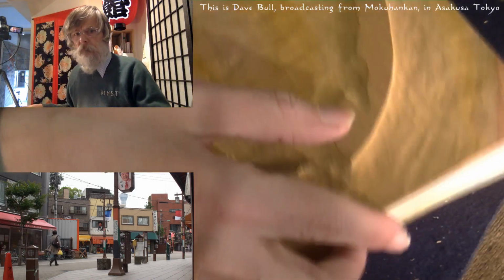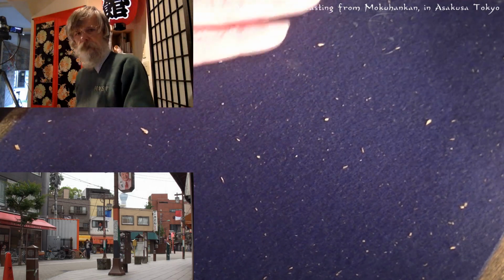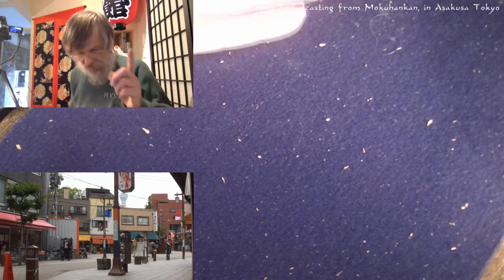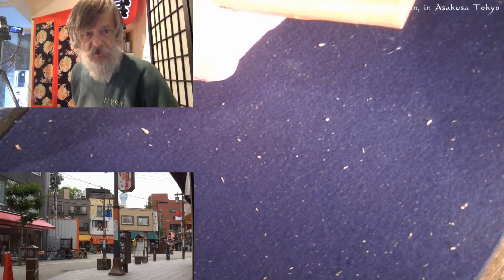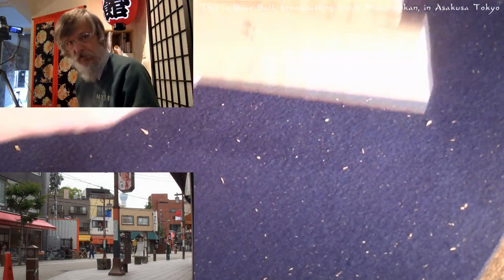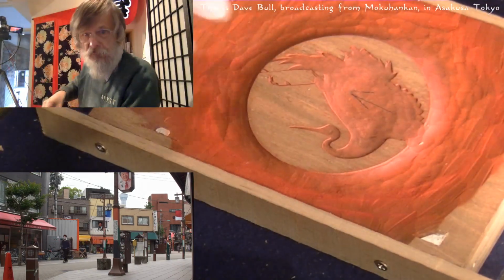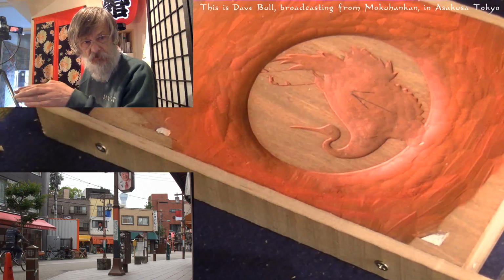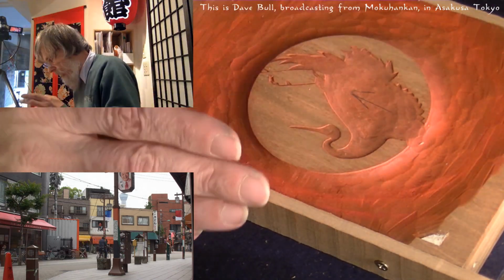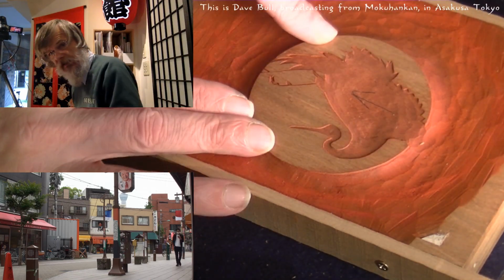And I'm like, maybe we can do this. So last night I got the blocks for the crane print and I did this. I planed off about 1 millimeter. Well, there's more to the story here than that. Here's the block set. This is the after. I can't show you the before. Before I did it last night, this was worn out like crazy. It was rounded. So I've planed off, I don't know exactly how much, I kept planing until the rounding disappeared.